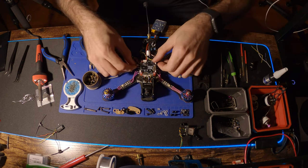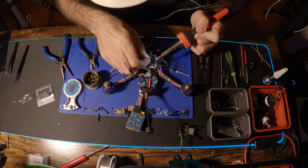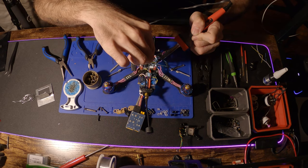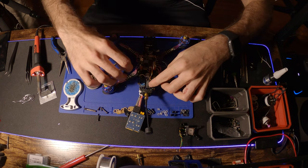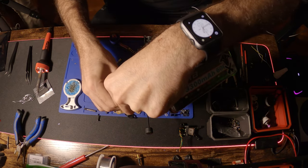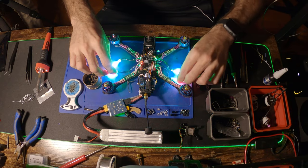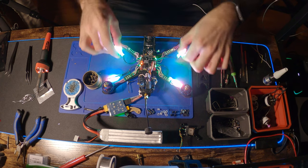Now we're going to take the LEDs, which is as simple as plugging them in. In a second we're going to grab a battery and test that out with the smoke stopper. I'm pre-tinning the pads for the Tracer receiver — same process as the VTX. The receiver wires are soldered on; you can look up wire mapping for any receiver you have. One last check with the battery: got a green light, didn't turn red, didn't make a noise — the LEDs are on and everything's blinking the right way. It looks like everything worked out really well.